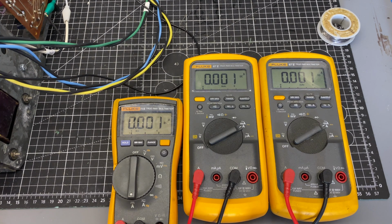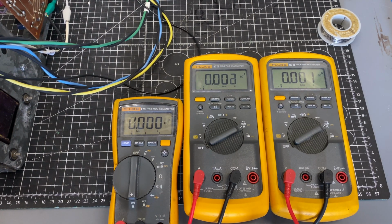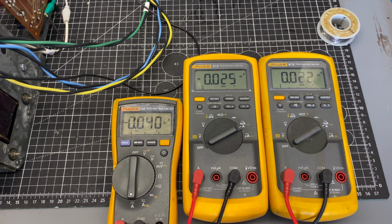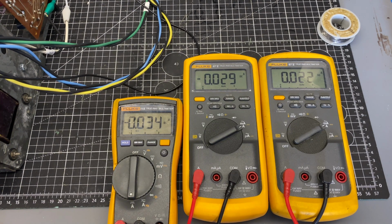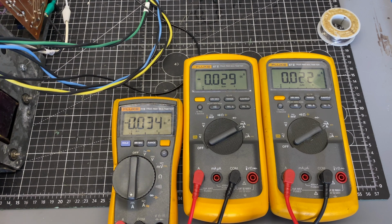of the controls and take the bias down from where it is. Then I'll put it on full power and actually set the bias. So right now I'm going to turn this on. And we can see we're pretty darn close to where we need to be. So setting my reference levels worked, but what I'm going to do is go to each one of the controls.